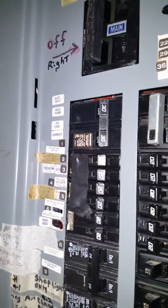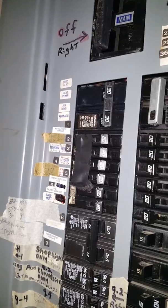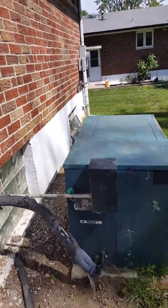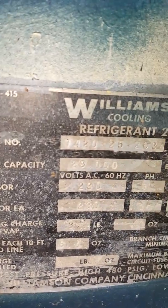Just make sure we put our paperwork over all the tags and stuff. I want to keep the filter. The breaker box — I believe it is the top left for the 30-amp, but it's marked for electric heat, heat pump, air conditioner, and furnace. I'm going to assume it's that one; if not, just make sure the customer knows which one it is and we mark it correctly.